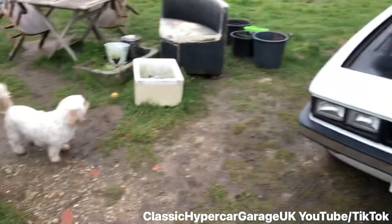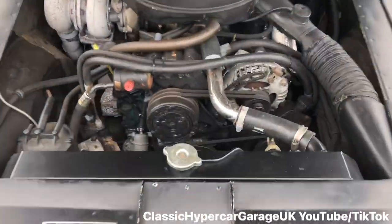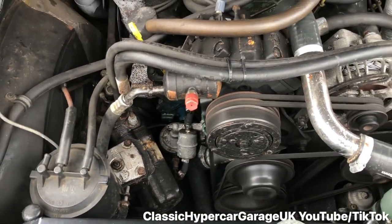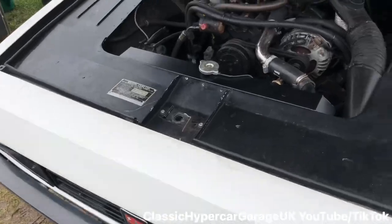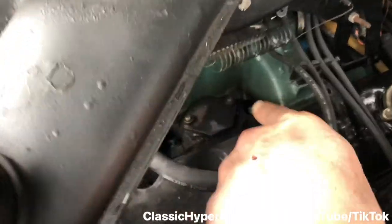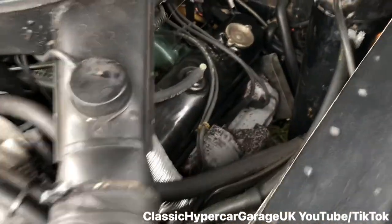You can see it all needs a little bit of a clean-up, but it's all running nicely. We're just going to tighten the belts up a little bit and check all the gaskets. I've got a little bit of oil down there — we're going to investigate that and see where it's coming from. Apart from that, it's all good.